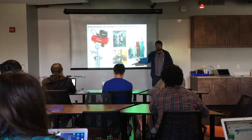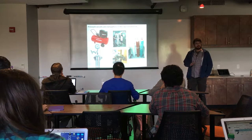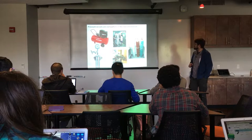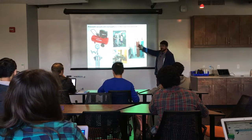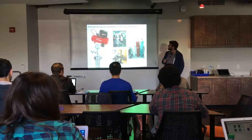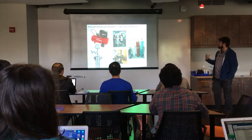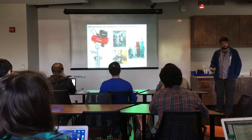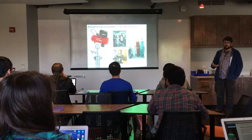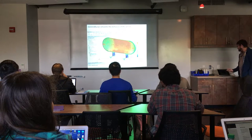We also have compressed gas tanks — generally around 2,300 PSI, a little over 2,000 PSI. They store a lot of energy. All of these things were engineered to safely store the maximum working pressure plus some factor of safety, plus probably some material defects, welding deratings, that kind of thing.